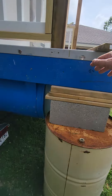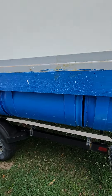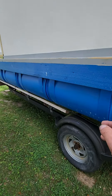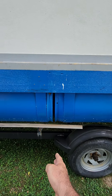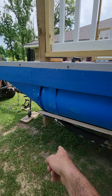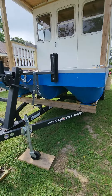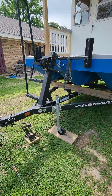My next step is to add some 2x6 bracing — you can see where these holes are — that goes down to the ground. I connect the bracing together, make another set further up, slide the trailer out, put another set of bracing in the middle, secure it, then slide the trailer up. Then another brace in the front followed by two more barrels in the front. That's how I get it on or off the trailer by myself on land.